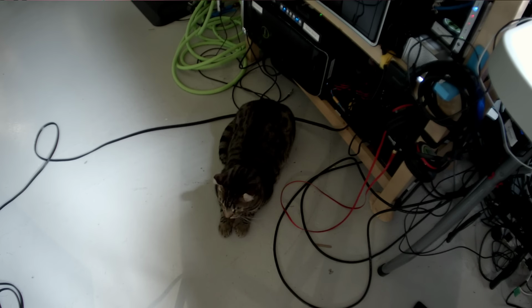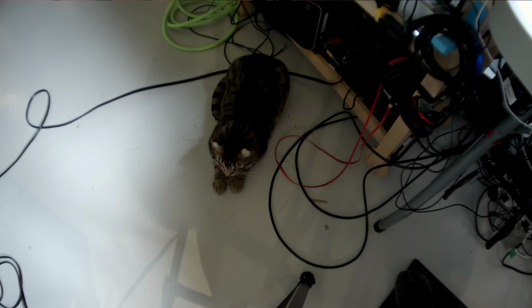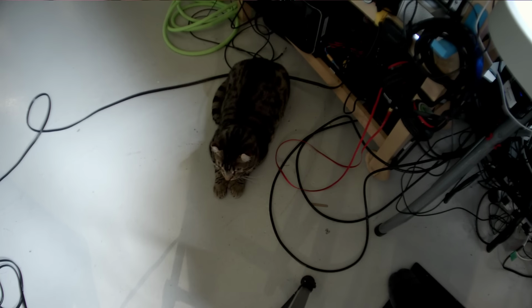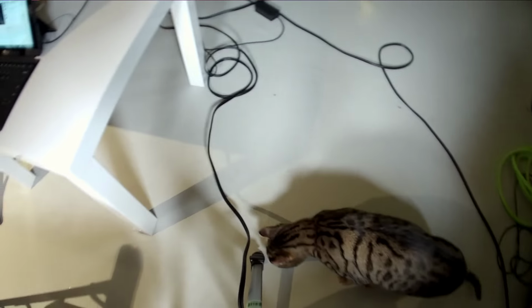So it was this super weird thing where the VFD was basically just a serial display. And even at the time, I could have put a USB hub in this thing and had my IR thing and then also a USB to serial thing. But at the time that seemed silly and wasteful. So instead I had this extension of the firmware that also gave it a serial port, so that in addition to transmitting and receiving infrared codes, I think I also added some LEDs, but then you could send data at, I think, 9600 or 19200 baud to this little vacuum fluorescent display, which would then do all of its own driving internally.